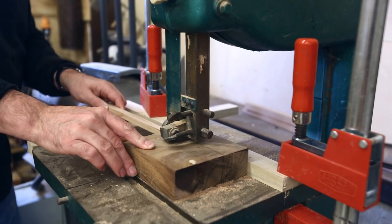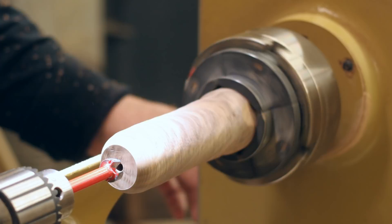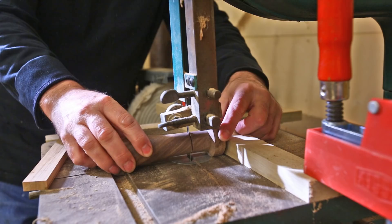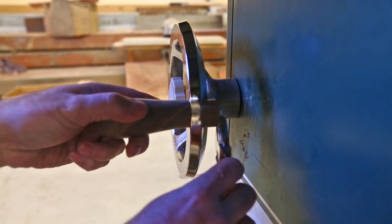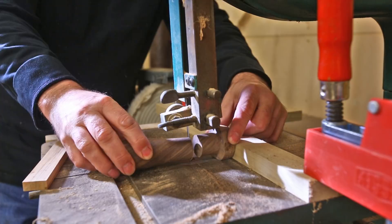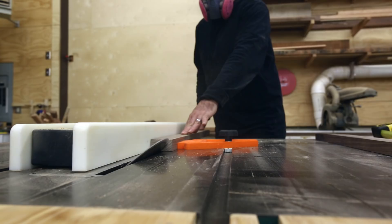Before I got into the angled cuts, I'd been meaning for quite a while to make a handle for the table saw. The wheel that angles the blade is missing the little handle, so it's hard to turn. I turned a quick walnut handle out of a piece of scrap walnut. I found there's no threading in the hand wheel, but I could use a bolt to hold the handle on with a nut on the inside of the handle.